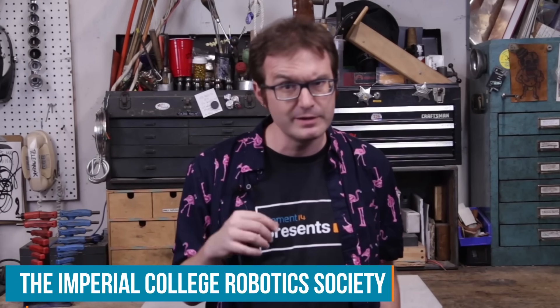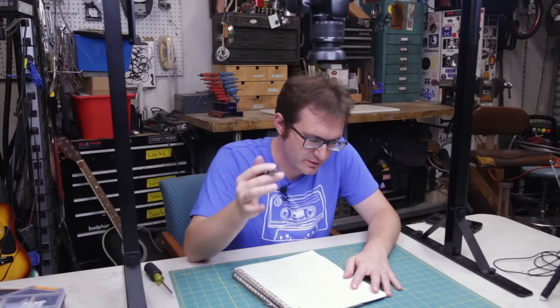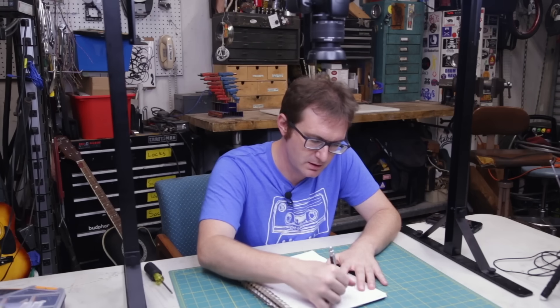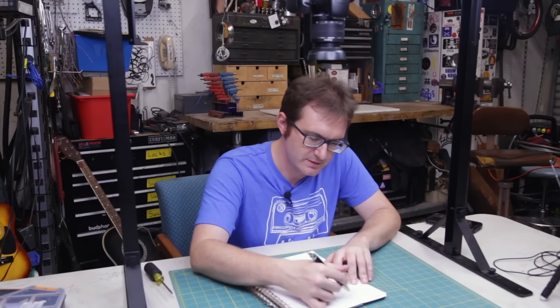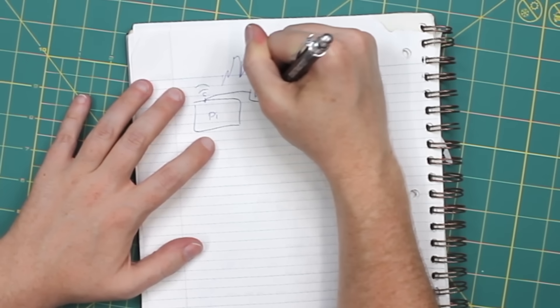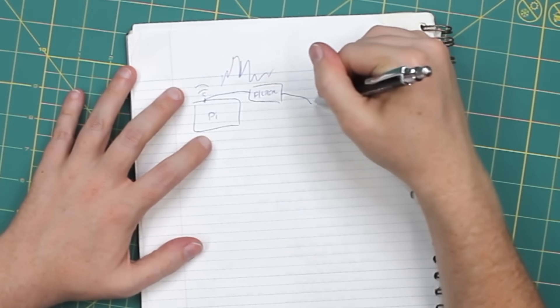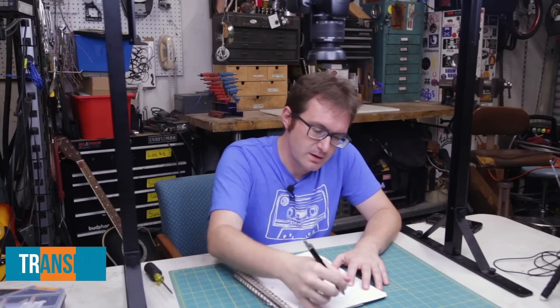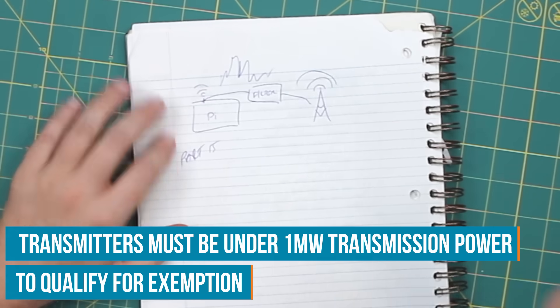I'm going to do it a little bit differently — I'm actually going to build this thing out of a Raspberry Pi. There's this clever group of hackers over in the UK that figured out how to bitbang an FM signal off of one of the GPIO pins on the Raspberry Pi. So I figure we'll take that, add to it, and see if we can make something that works. I'm thinking an FM transmitter out of a Raspberry Pi should be pretty simple. We have our Pi, and it's probably going to be noisy, so let's give ourselves some kind of a filtering device, and then from there we need an antenna.